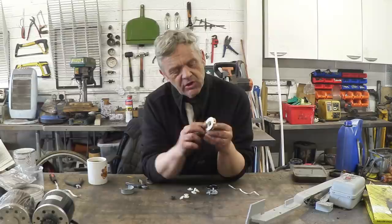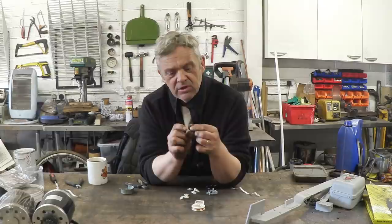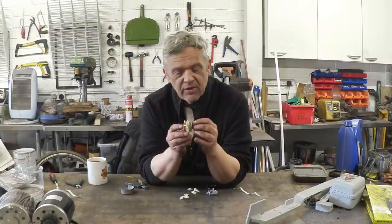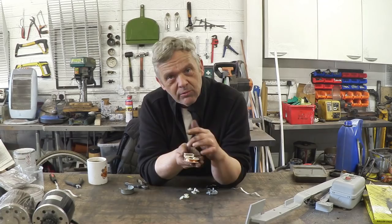I'm sure we've all seen these on YouTube where they're used as generators — they just put a hand crank on it, turn it around and light an LED or two, which is really cool. But the fascinating thing is this little arrangement. The coil is actually wound in that direction with two outlets, and the magnet is oriented so that the north is one way and the south is the other. So as it rotates, we have that north-south field cutting through. But normally you see coils wound the other way — that's how most people wind their coils in motors and dynamos. Here, what we've got is the coil wound around the magnet.